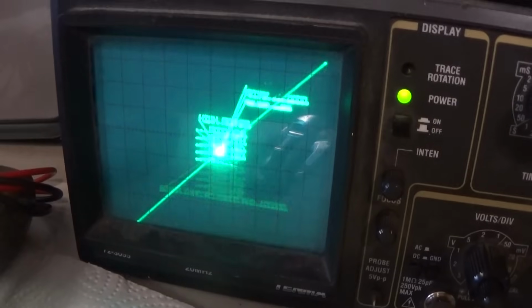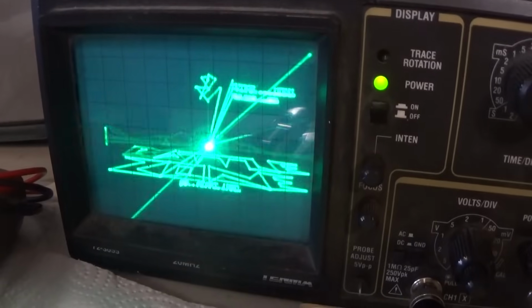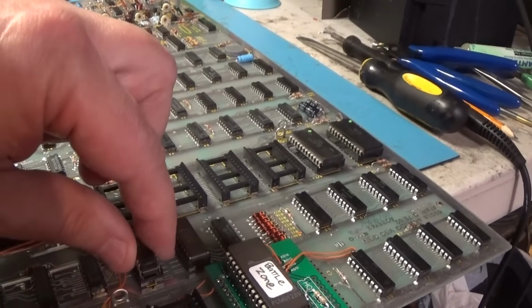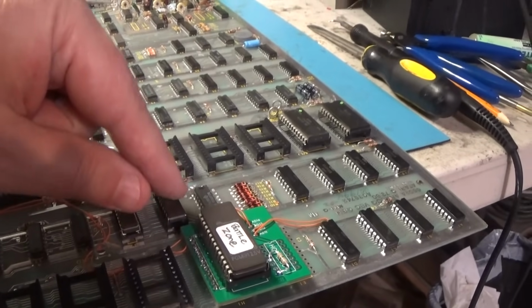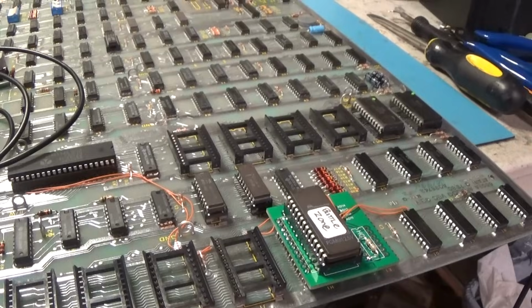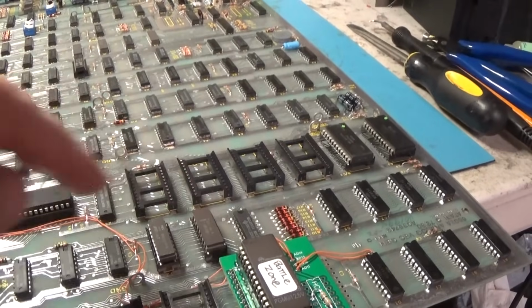Well, I replaced the CPU. And I now have BattleZone rolling. But something is not right. BattleZone. Remember when my RAM were bad until I jumped RAM over it? Something's wrong with the decoding and it's flaky. Something's flaky with the decoding, and when I jump a chip over it, it settles it down. So there's actually a decoding error on here. So the CPU is not the problem. This CPU is fine. It's in the decoding, and the RAMs were actually probably fine.